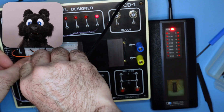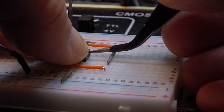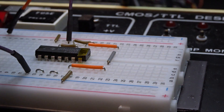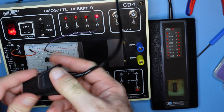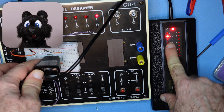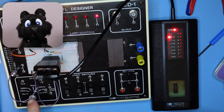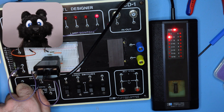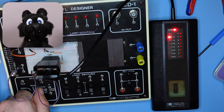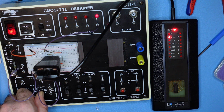The test circuit is running with a clock signal of 10 kHz, just to make sure that we are not just seeing a DC result. So in essence, this is a very simple in-circuit chip tester. The only thing to consider is that with stateful ICs, like flip-flops or counters, you have to make sure that they share the same state — either they reset after connecting, or connect the comparator before powering on the device.